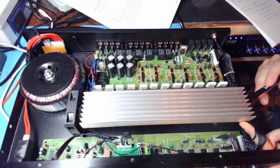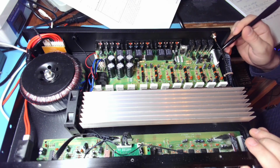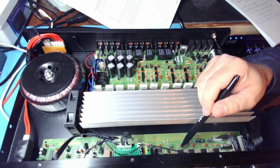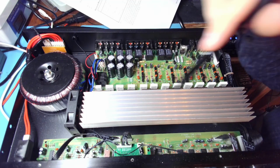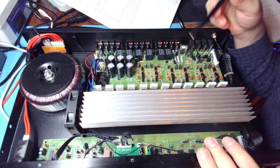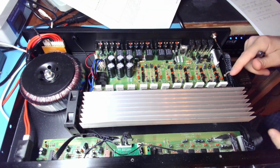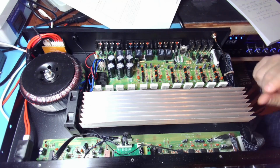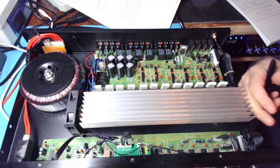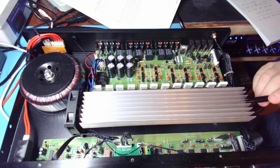Small issue, this cable over here, the data cable. It controls the relays, gets V plus, V minus, and the inputs for these op-amps. Op-amps are 4558 standard, nothing to write home about. And that chip over there is just responsible for echo. It's an audio processor. But it's not great that this fan should be here and those cables should go, you know, at least on the previous device, it had a little protection, a little tube on it, so it doesn't touch the heatsink directly. But here we figured, so what, it's touching the heatsink. Heatsinks don't get hot, right?